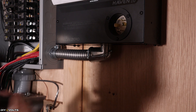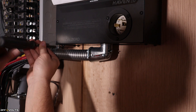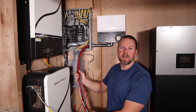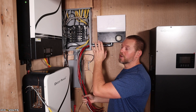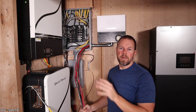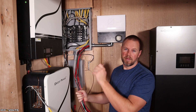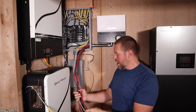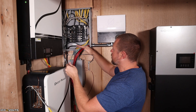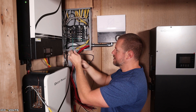There's also a screw over here that needs to be tightened down to keep the conduit secured into the main panel. I now have all the wires here in the main panel ready to be connected. Very important — the power is turned off to this panel, so no matter what I touch I won't be electrocuted. Keep that in mind when working on a panel like this: shut off the power because you're dealing with hot wires directly. First step is to isolate the green wire, which is the ground, and connect it over to the ground bus bar.